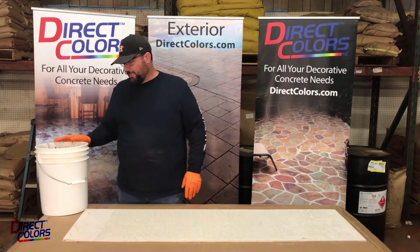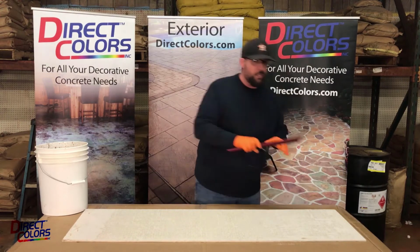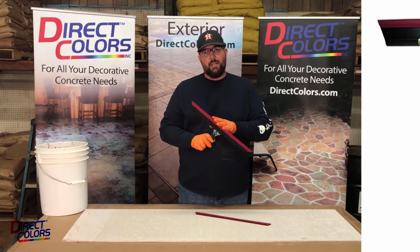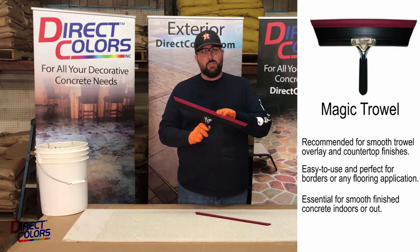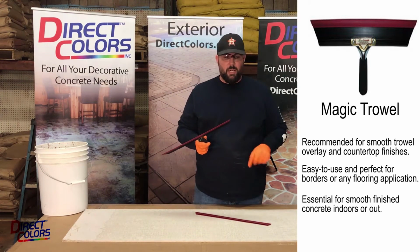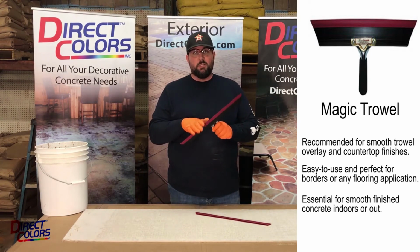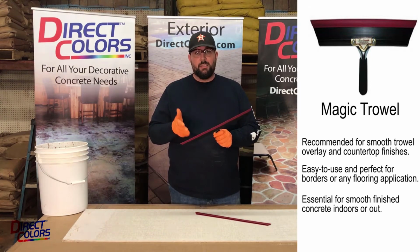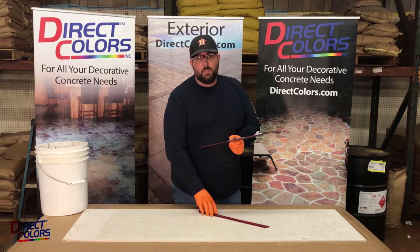So here's the overlay we mixed. I've got a tool right here called a magic trowel. This is really handy if you don't have a lot of experience with a metal trowel or steel trowels. This has a soft squeegee blade. I don't know if you can see that moving, but if you try to use a metal trowel, every little twitch you have in your movement is going to translate into your finish. This gives you a little bit of forgiveness, so it's a great tool. Direct Colors does sell these in 12-inch, 18, and 22-inch widths. This is an 18-inch width. I think it'll work really good for the project we're doing at hand.